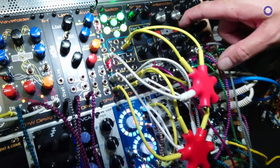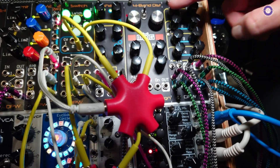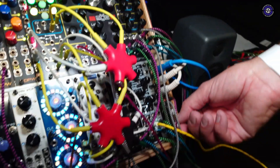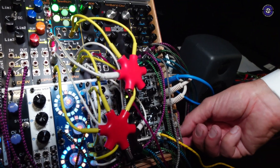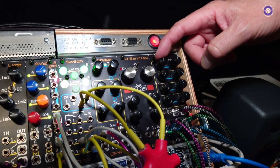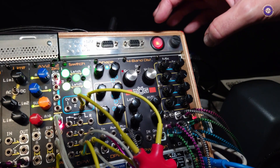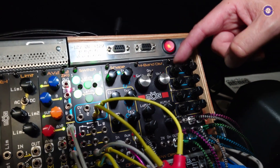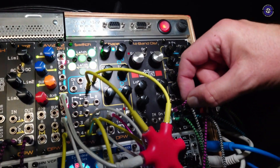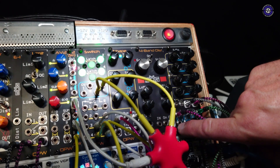It's four channels — mono or stereo — but then you have these M switches. If you turn the M switch on, these four inputs left and right become two mono inputs. If you go stereo, you have one kick on one side and a very low kick on the other, and you get two times amplification. If you put something in on just one side, you still get two times amplification because left is normalled to right and right is normalled to left.